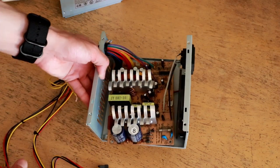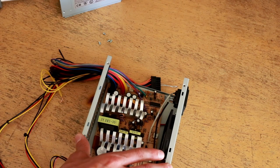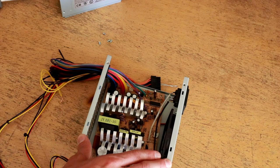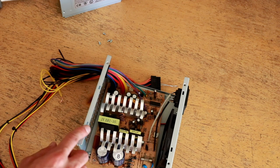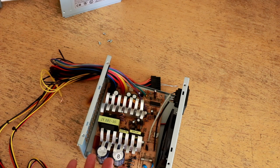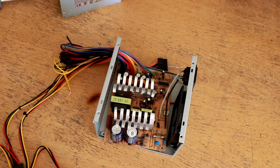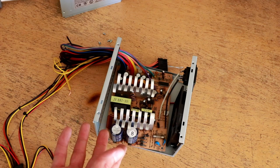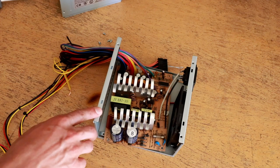For the price this is certainly a good grade, and as a power supply in general maybe a B-minus. It's definitely something I would consider using on an economical system. There is a concern about potentially it being a fire hazard if it were to fail catastrophically — I would like to change the glass fuse out for an HRC fuse, an actual properly rated high voltage fuse. But other than that it's probably not going to give you much trouble. I'll have a link in the description to where I bought this — I'm not sponsored by the manufacturer.